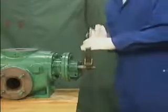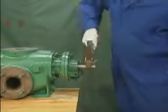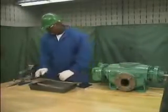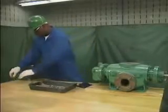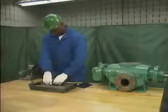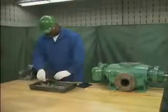After the pump is completely reassembled, the mechanic turns the rotors to make sure that they turn freely without rubbing. This pump is not being returned to service right away, so the mechanic does not have to fill each oil reservoir. He'll finish his part of this job by picking up his tools and making sure that the work area is clean. Try a question now to make sure that you understand the material that we've covered.